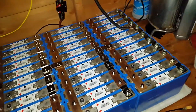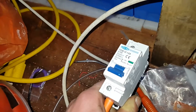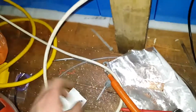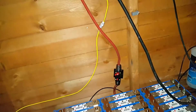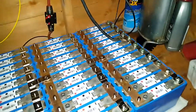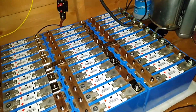I'm just going to have to get everything put in place. This here has a 100 amp circuit breaker and it will be going on the positive over there. I've just used some of the high voltage cable as an extension because the cable in there is not long enough. The 40 amp circuit breaker — actually that's a 50 amp — will go somewhere else. I've just got to get all 120 of these nuts in.